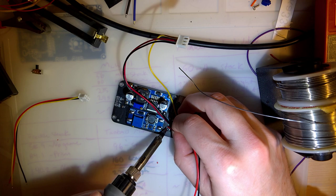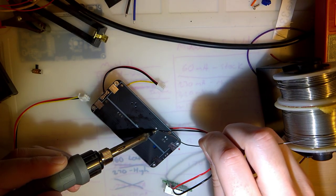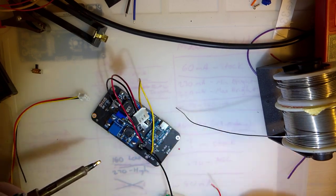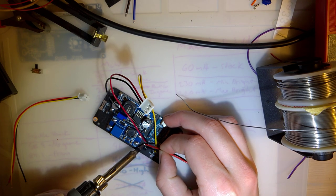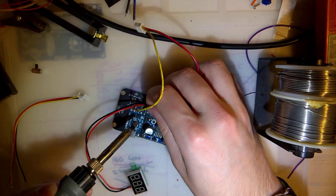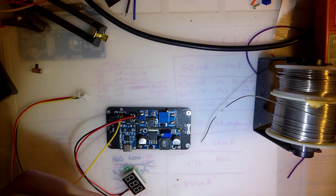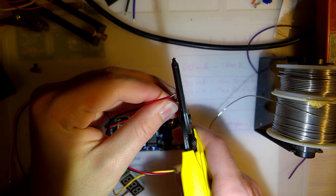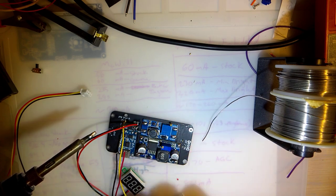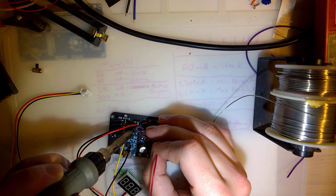And so these are just through holes, like if I was using header pins. But I'm just shoving solder and the wires straight into the holes here. Just gonna add a little bit of extra solder. Make sure these are all happy. And I'm gonna redo these ones because I don't like how much wire is sticking out. So in this case, I'm just trimming off some extra so the wire's not so long. Okay. Do the red one first because that's the inside. Should have done this first. Whoops. Oh well.